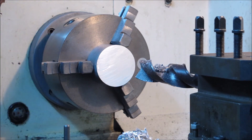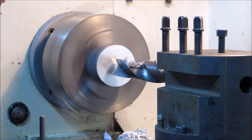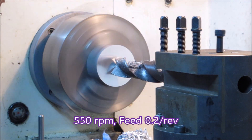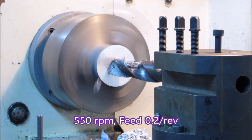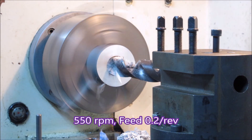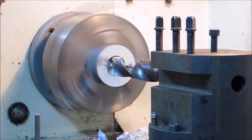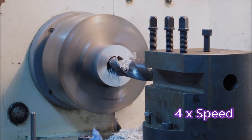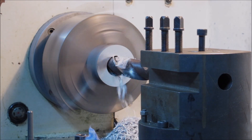Here we have me drilling holes again using that great big cast iron block I showed in my last video. It's a bit of a coincidence that it came up straight away that I had to make some venturis. These venturis are just prototypes — I won't be making them in the final production run, but I'm quite happy to make a few. I've got everything I need, so it's not too difficult. There's the 32mm drill going through the blank — power fit.